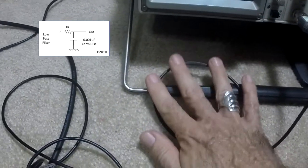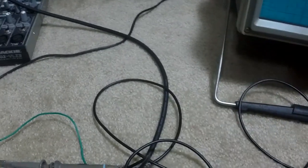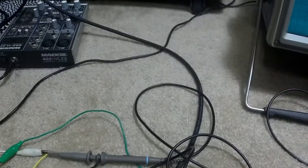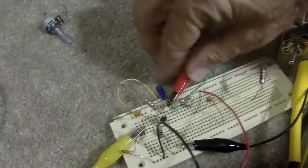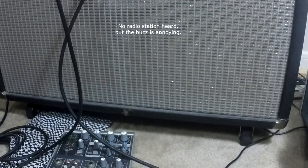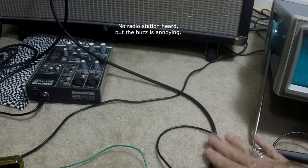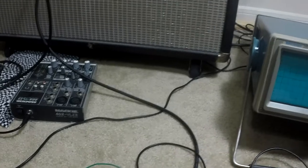Back here. So even if you're not hearing a radio station coming in, stray capacitance from holding the cord is enough to have your body create an antenna effect onto your pedal effects or your pedal board, which is why we install an RF filter. Just so while you're touching the pedal, the line coming into the pedal, that's the reason we install an RF filter.